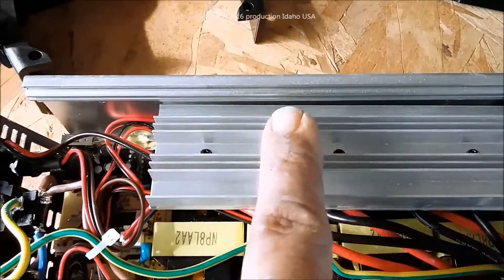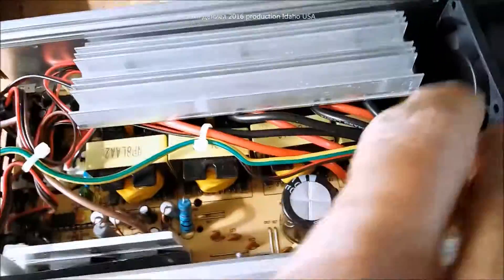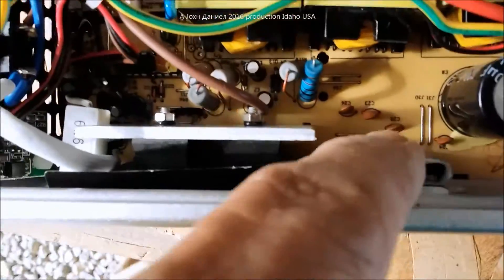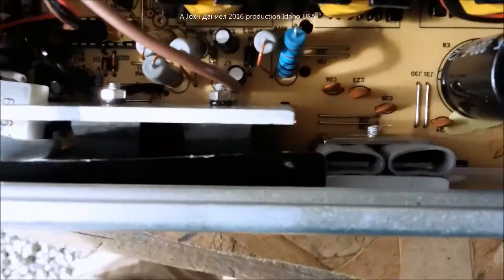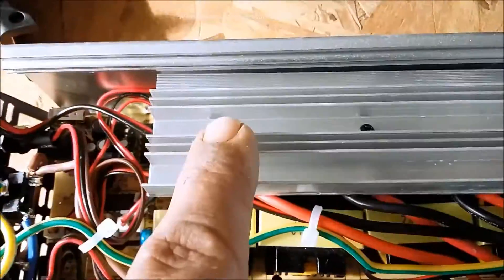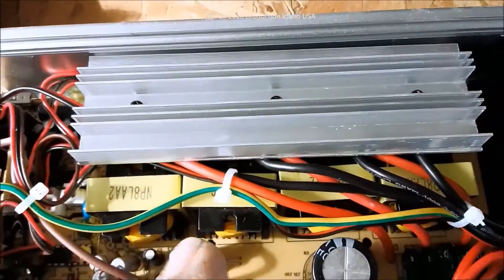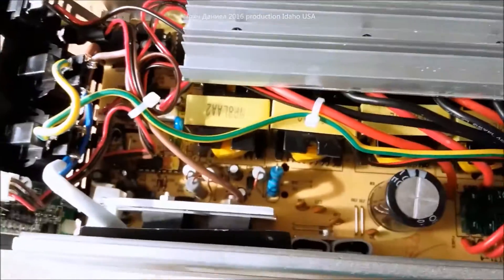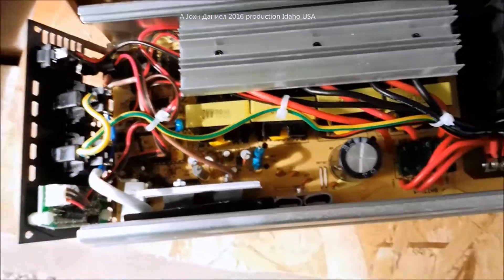This is the internal components of the Peak. It has a very beautiful cooling system — right in front of the fan it has direct-to-body cooling and additional cooling vents that allow full airflow past these high-powered MOSFETs, where your voltage comes off, and your stepping and staging MOSFETs. It has nice spacing and ventilation through the bottom — a very good designed inverter, which might be why they last so long.